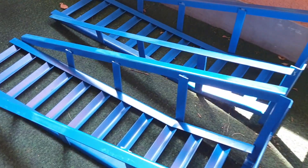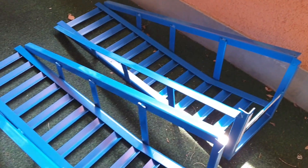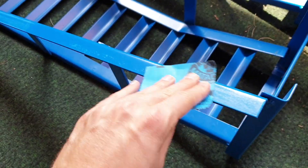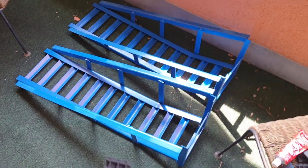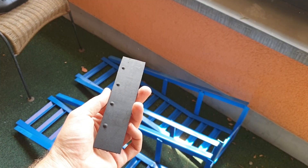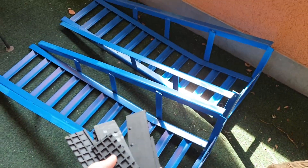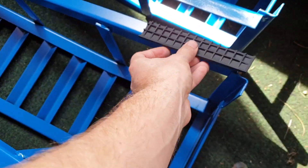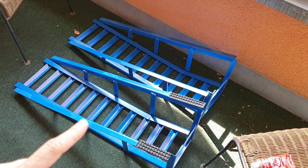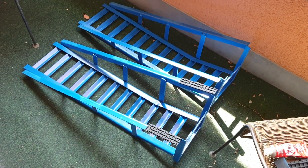These are the ramps, and as you can see, pretty smooth and slippery on the bottom. We will scuff this up first by using some sandpaper to remove the paint and make it a little bit rougher — not for the contact itself, but because we want to put something on there. We will use this, which is pretty much just a sliced car rubber foot mat, and we will put those small pieces on the scuffed-up surface. We'll use multiple — six on one ramp, and also six on the second one, so twelve little rubber pads in total.